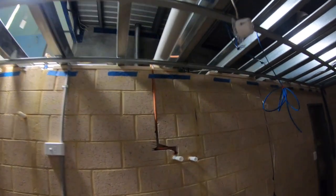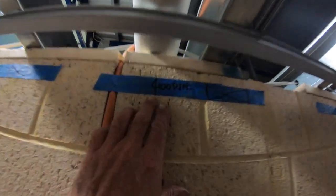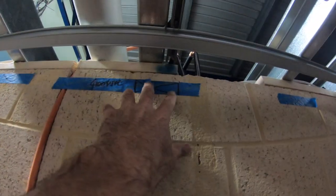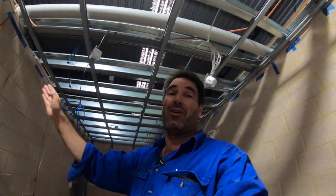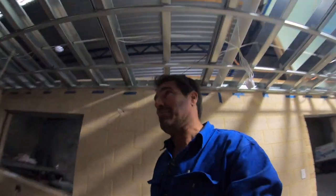What I've done is marked here — it says 100mm pipe. So that's for the fan exhaust for the ambulant toilet. I've also marked where the steel is, so later on down the track when the ceiling's up and we're going to put a down light here, we can see whether we're going to hit something or not. So it just makes it heaps easier later on — I've done that all the way along.